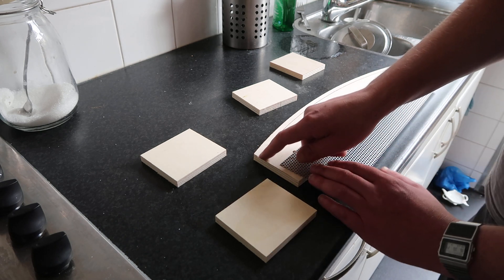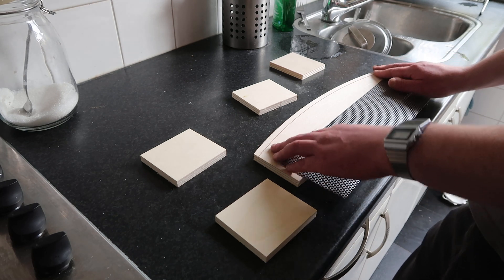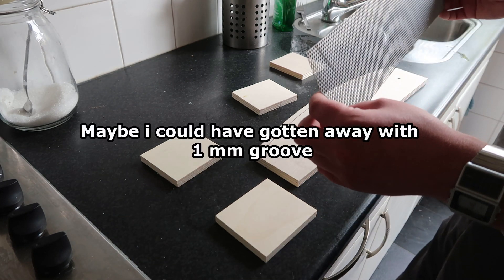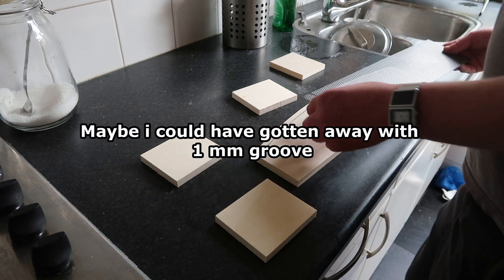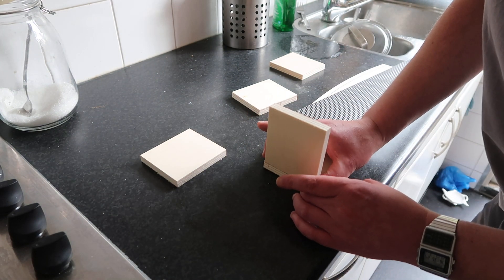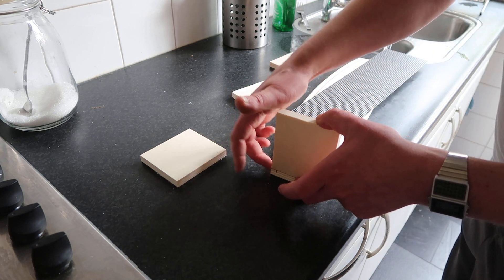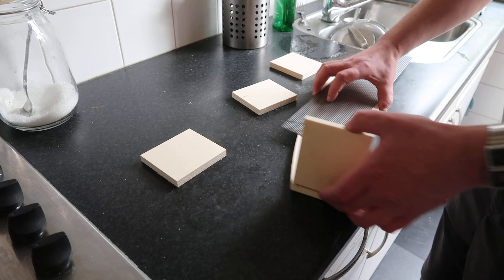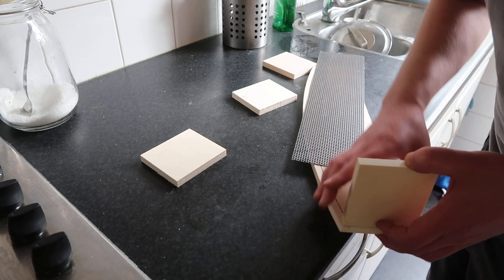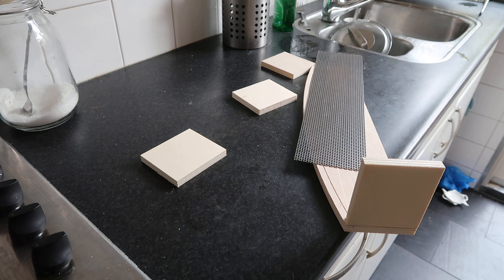And that is — I made a groove in here. That's 1.2mm wide. This is 1mm metal. And the idea for construction is this part is going to sit here. It's not exactly right, and the reason for that is that on this side I'll grab a measurement device — it leaves room.